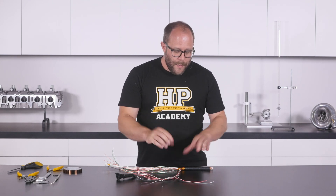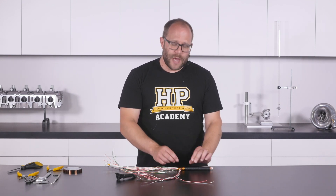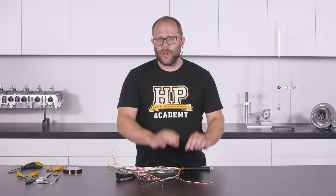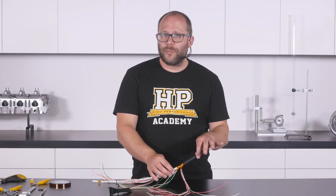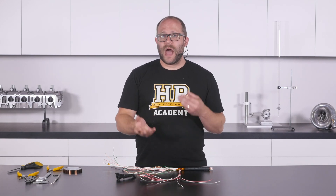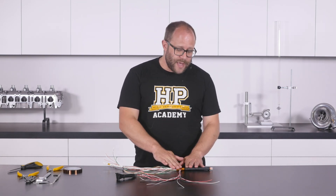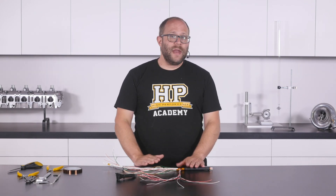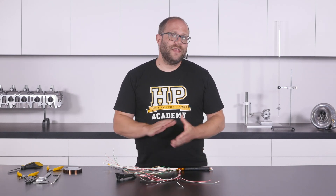You'll notice that I've kept our Kapton tape within quite a confined area, and that is for a very specific reason. The moulded shrinkable boot that we are going to be shrinking onto this has a specific measurement and we need to make sure that we keep all of our supporting Kapton tape within that. The particular boot you're using in your application will have documentation that will let you know these measurements. This example shows that while we are striving for our bare branch point to be as tidy as possible, it's not like a twisted harness section where every wire has a defined place before we begin. The strain relieving and sealing that Kapton tape gives us goes a long way to smoothing out the branch point, as well as giving us the barrier between the wires and the sealing adhesives that will be used when the point is booted during final assembly. We now need to continue with our concentric twisting layup plan and then look at sheathing the rest of the sections of this harness.